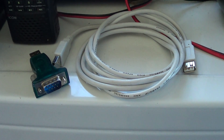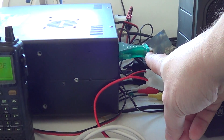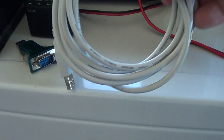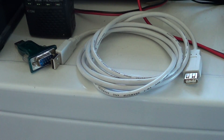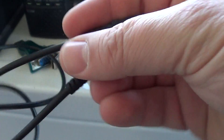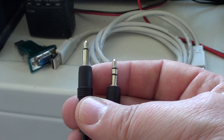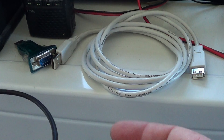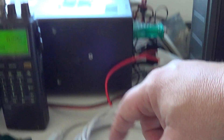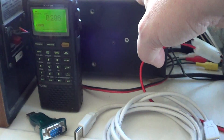So here's what you need: if you have an ICOM ICR-8500, you need a DB25 to DB9 adapter, a serial to USB adapter, and a USB extension cable. If you have an ICOM ICR-20, you'll need the ICOM CIV cable, which is a DB9 at one end and two 1.8mm plugs at the other end — one is for audio, one is for the data connection. You can also replace the DB25 to DB9 with this CIV cable if you're using the ICOM ICR-8500.